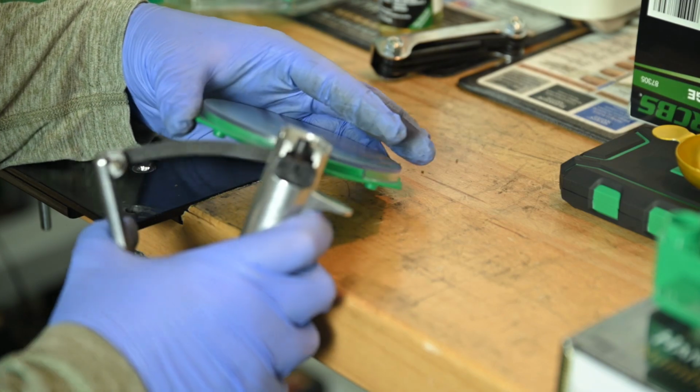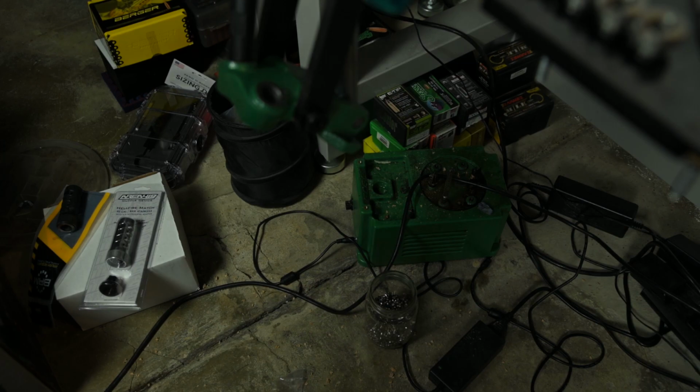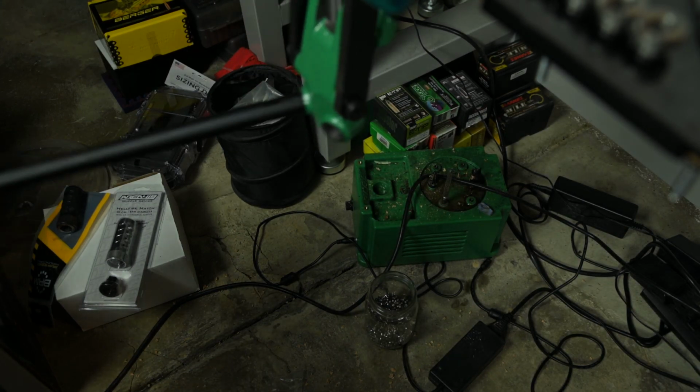This press does not have an option to prime on it and doesn't have a collection primer tray either, which is why they include a hand primer ultimately. It uses a chute in the ram to dispense the primers below, which you'll need a bucket to collect. The press is really rock solid. It doesn't have much play at all.